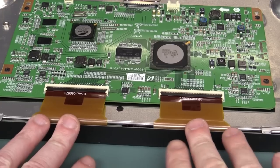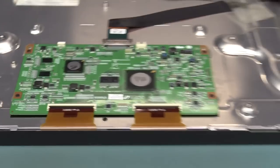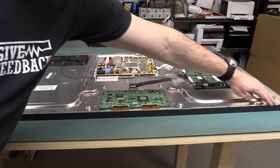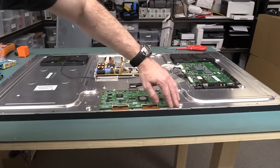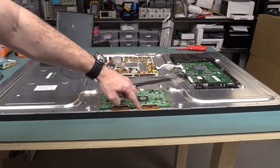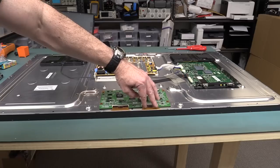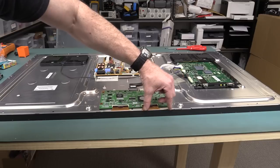They would have all the column drivers on them that actually go down. So it's most likely that this connects up into here and then you've got what I'll call the driver board, tucked away inside here. Then there'll be multiple flat flexes again, with like a hot bar solder attachment — flat flex bonded directly onto the PCB itself using a hot bar technique, as it's usually called.